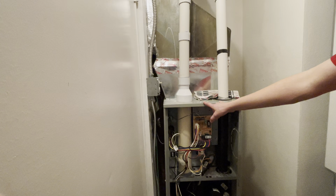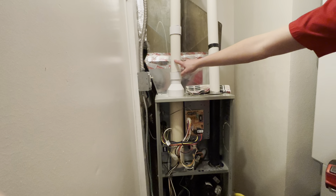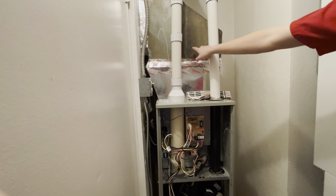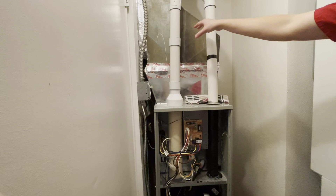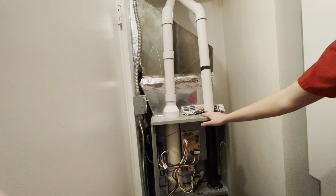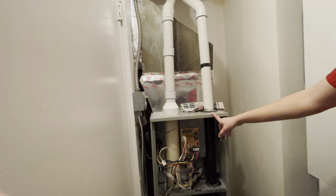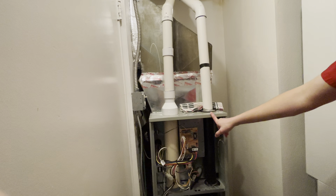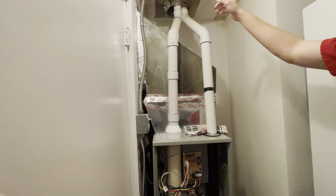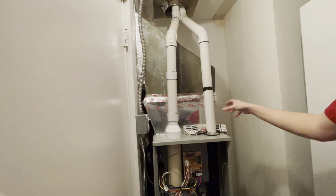We also have two inch for the fresh air and the exhaust. You have three inch going down and it condenses down to two inch going out through the roof. There's a lot of water — it just kind of comes down here and we actually have a cloth here to kind of help prevent any of that from pooling over too much and getting inside the system itself. It sounds like it was due to this not being sealed properly, as well as up above on the roof. That is one thing I do want to have addressed and make sure we don't have any issues.